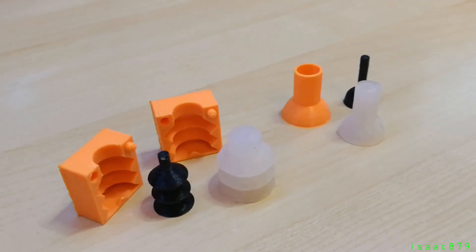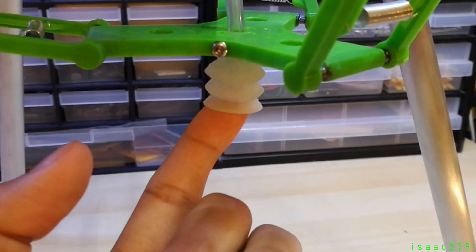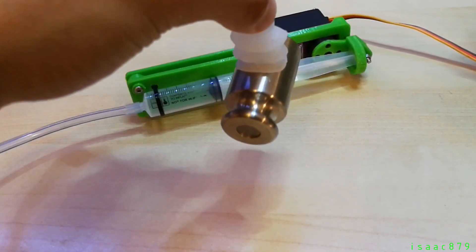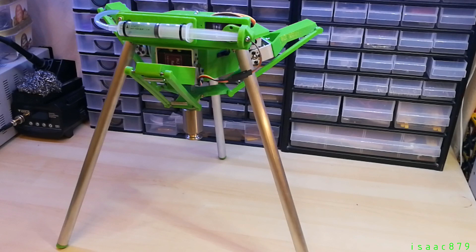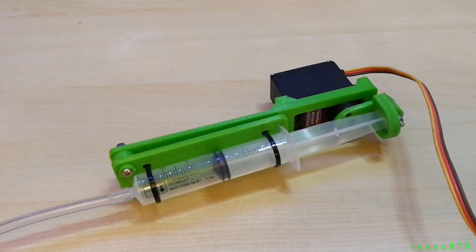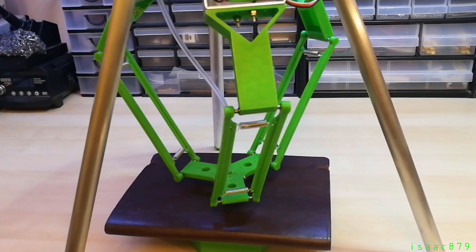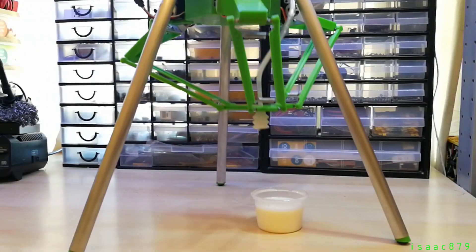All the CAD and STL files for the syringe actuator and the moulds are available on my Thingiverse — link in the description. So why use a vacuum gripper? Starting with the advantages: the end effector is soft so it shouldn't damage anything it picks up. It will deform to the curvature of the surface so it can pick up various shaped objects. Once the plunger is retracted, the servo draws minimal power to hold it. Controlling the gripper is easy as it just uses a regular hobby servo. There's no noise from pumps to maintain the vacuum. There's no size limit for what can be picked up as long as it fits under the robot and isn't too heavy. The end effector is very light as it's only a suction cup and some tubing. It can even pick and place liquids.